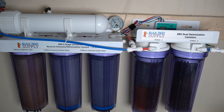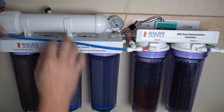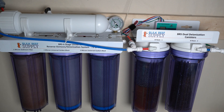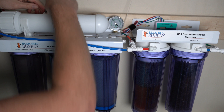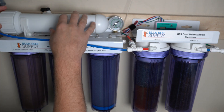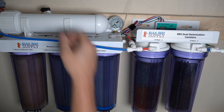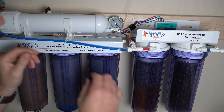There are actually a lot of breweries where I live because of the water quality. When the system sits off for a long time, particles collect on the membrane and then have a chance to come off — this is called TDS creep. That's why when you first turn it on, you want to flush it. There's a switch here, and when I turn it you can see the pressure drops to zero. What this does is allow water to flush through the membrane without pushing through it, which prolongs the membrane's life. Then you restore pressure and it begins reverse osmosis again.